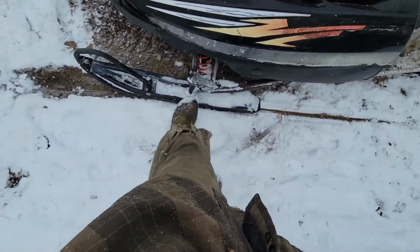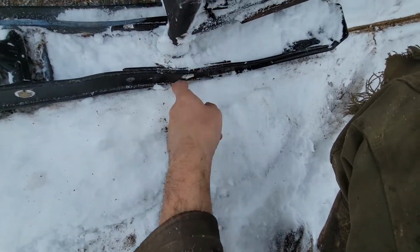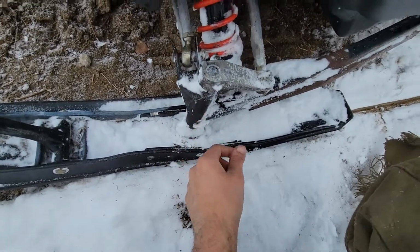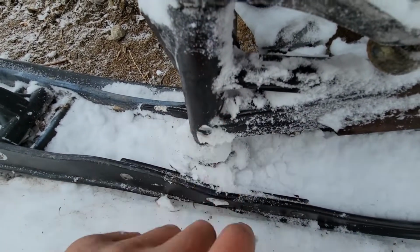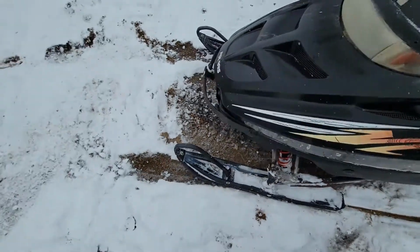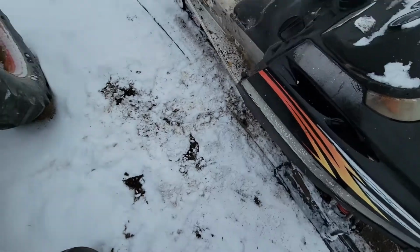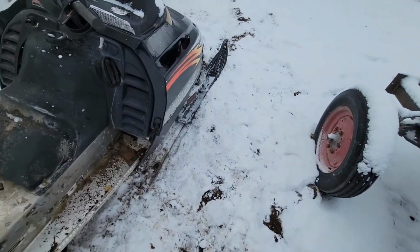Yesterday, we just had to pull this bolt here and knock this rod out because it was completely rusted stuck. So that was all we did there, and I put marine grease in it. And there's a hole right there. And that hole, I think at one point there was supposed to have been a grease zerk there, but there isn't a grease zerk anymore. So yeah, it just gets water in it. So I put marine grease. I've always found marine grease to be very good at resisting water. I think it's even rated for salt water, the marine grease I have. So anyway, I put marine grease in both of them. It turns fine.